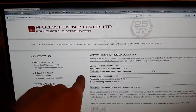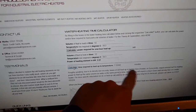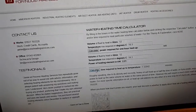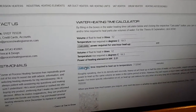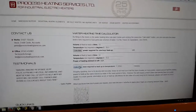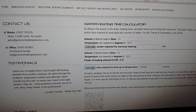Here are the results of the test from the start of the video. I heated up 12 litres of water with a temperature rise of 19.3 degrees from start to finish, over 7 minutes and 31 seconds. Based on that, the heat pump put out approximately 2.21 kilowatts of heat. I'm not sure if that's quite right — if it were, that would imply a very efficient system, considering at times it was only consuming about 800 watts and went up to 1000 watts when the wind blew through the evaporator. Though I think when I was using it to heat the hot tub it was actually less efficient, because there wasn't as much wind getting through it — it was sitting right on the ground in a sheltered area.